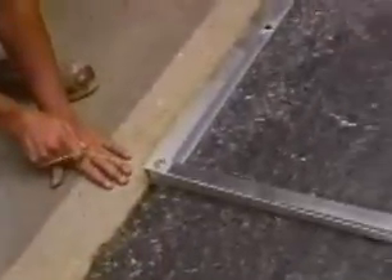The foreman needs to know what the choice was so he can lay out the job properly. Once the job is laid out, you're ready to excavate. First, you run string lines from the grade sticks and then measure down for elevation.